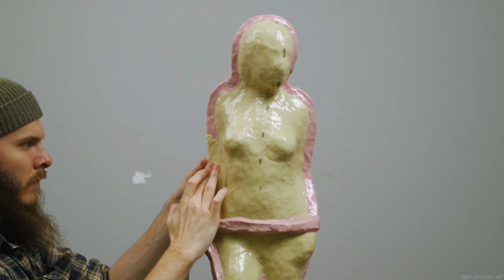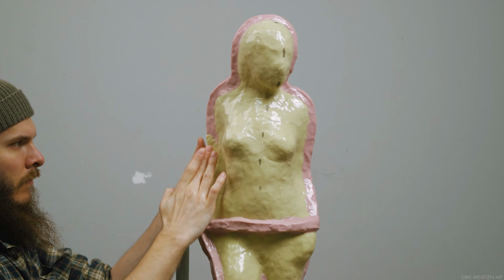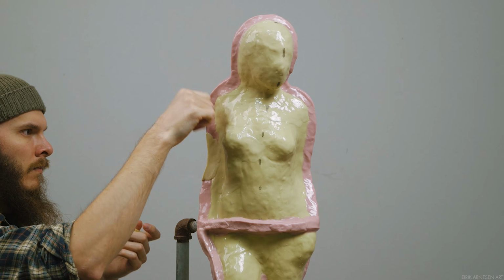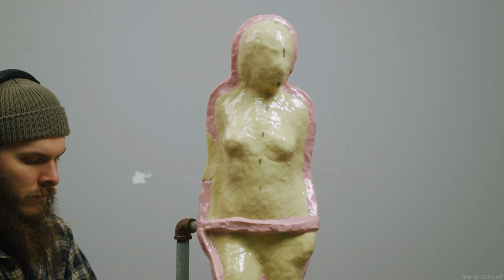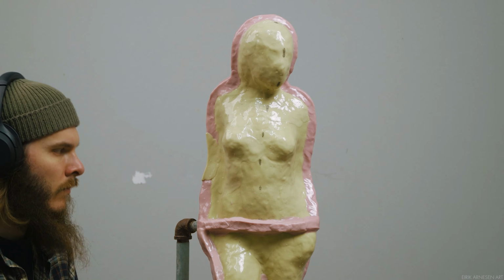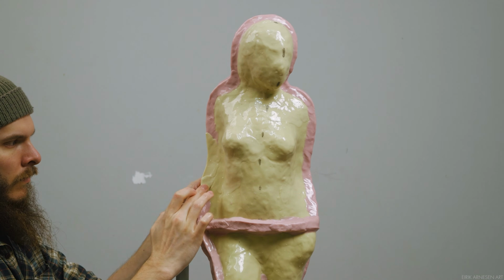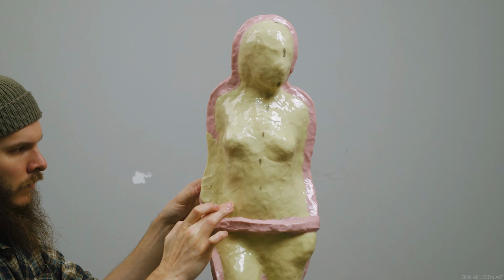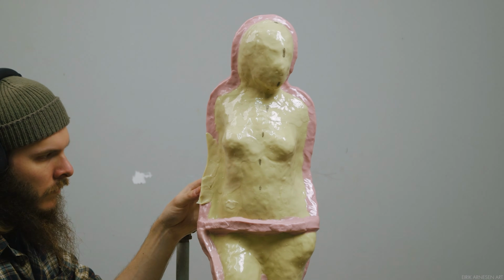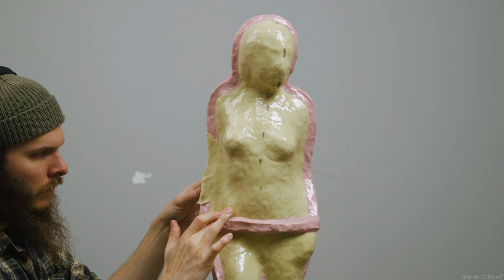I'm after a completely smooth result here, one that has no lumps, no bumps, and one that is square with sharp 90-degree corners. The sharp corners and attention to detail is going to prolong the life of the mold because there will be no points where the silicone could snag and begin to rip. That's with the smoothness factor. And the square corners make sure that I will have no problem with the registration between the silicone and the mother mold.